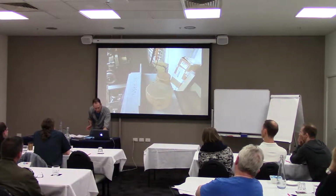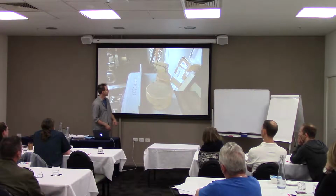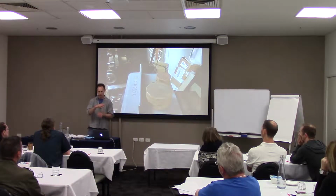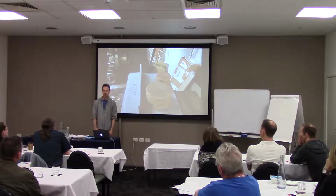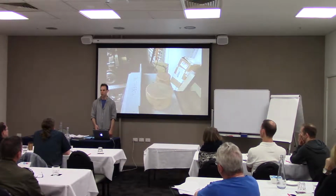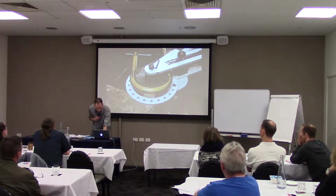Well, before I show you that, these are some bending units. There's a Furries. I'm sure a lot of people have this one. Furries makes this. It's not a very good picture, but there's a bunch of different holes where you can move, and there's about 4 different blocks. I've made a bunch of different ones too. They're bending jigs, and they're good for lead pipes. If you have to make a lead pipe and you fill with pitch, you can bend with that. And I'll talk about pitches too.